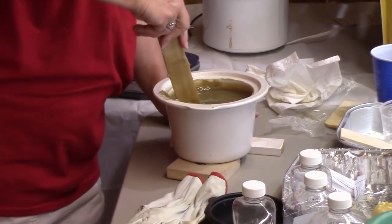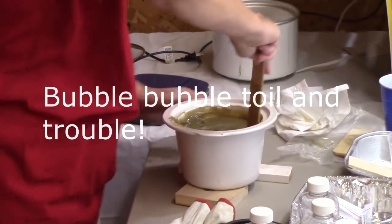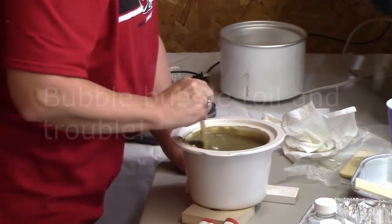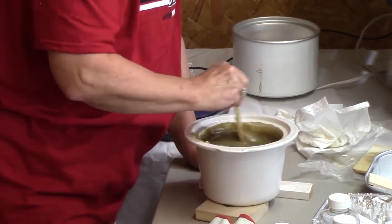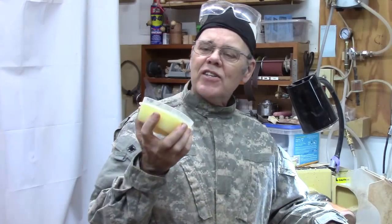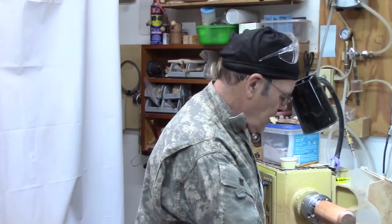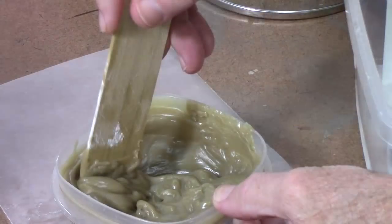It's an emulsion and it needs to stay in suspension, so you need to keep stirring it until it's just about dry in the pot and then scoop it out. Otherwise, this concoction of beeswax and mineral oil makes a great sanding paste — I showed you how to make this last week. This week we're going to add a secret ingredient to turn it into a sanding abrasive to get rid of really fine scratches.